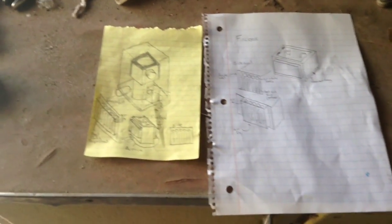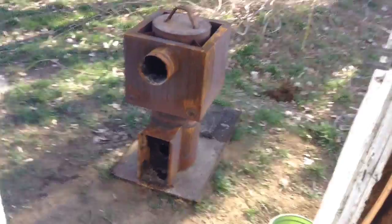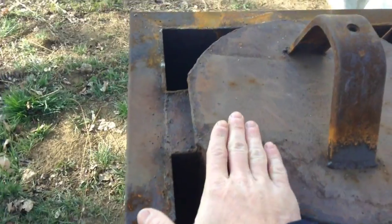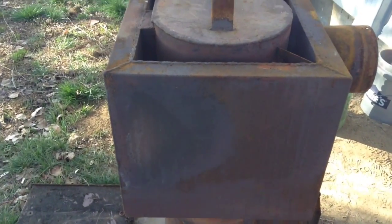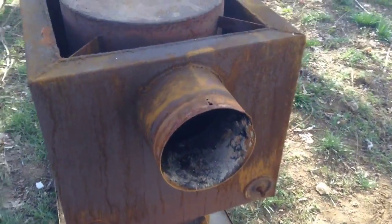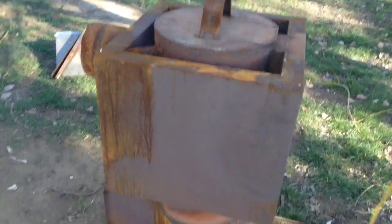So that's a quick overview of my plans for a much better rocket mass heater. I should have a lot better burn and better heat exchange with the insulated core. The only thing I'm not sure about is how well it's going to work with the fire box coming up the center — the exhaust from the center cylinder comes out and fills this outer square. This may be a plus and give a lot better heat radiation, or it may be worse — I'm not sure. At any rate it goes through the box and out the exhaust here.